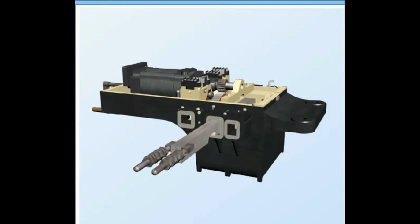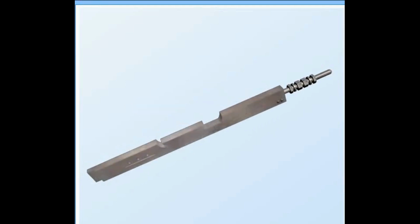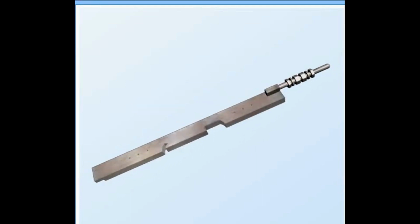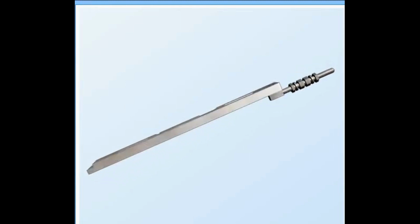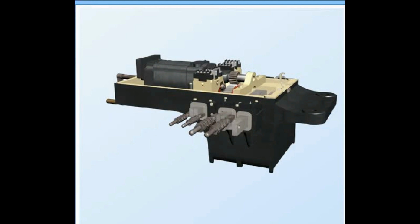Slides are independent for each switch and move along with the switch rails, that is 115 mm in broad gauge and 100 mm in meter gauge. These slides have one short and one wide notch, and because of the wide notch, these slides are common for both broad gauge and meter gauge.